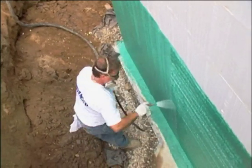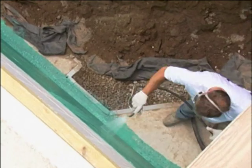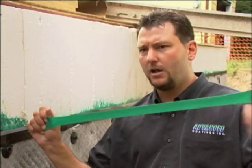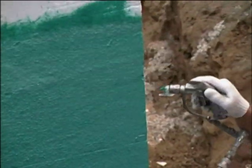On a residential foundation, every foundation moves — maybe a tiny bit or a fair amount. So when you use a high-end waterproofing like Rubber Wall, it's very elastic so that those tiny hairline cracks, the rubber can bridge the cracks. When you use traditional damp proofing, it can't bridge those cracks, and water is allowed to flow through.